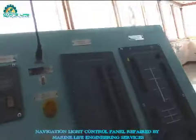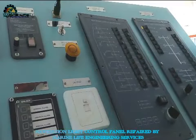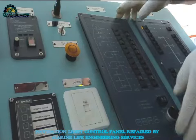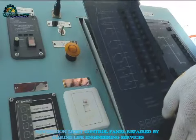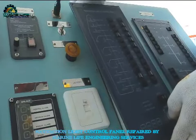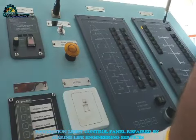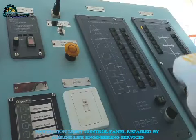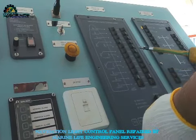It's the same as when we drive a car on the road — we have side lights, right side and left side. The same thing applies on board ship: we have to switch on the navigation lights. The port side is normally the red light and the starboard side is the green light, and forward and up is the white light. Without these lights, it can be a deficiency.